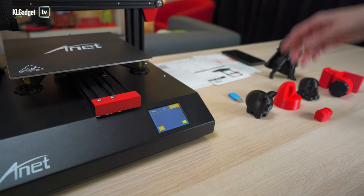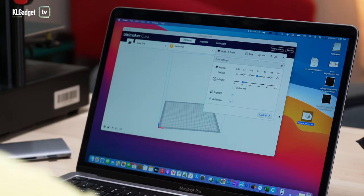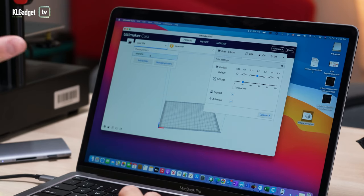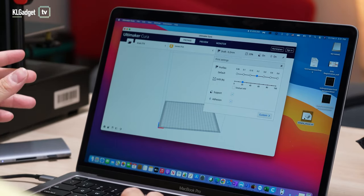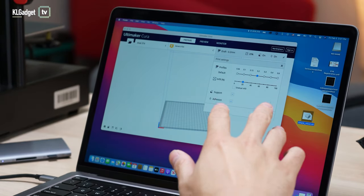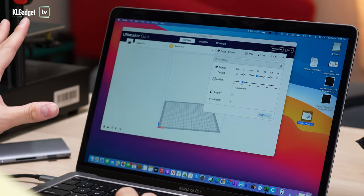Now I'm going to print something really simple with the E-T4 printer. I have the Ultimaker Cura software, which is the recommended software to use with this 3D printer. It supports a variety of 3D printers. When you install the app, make sure you have your preset configured, because this will have all the printing parameters set. All you need to do is import any 3D object files or STL files into the software. The E-T4 uses a file extension called G-Code, which saves all the printing instructions into a single file, and Ultimaker Cura is what converts STL files into G-Code.